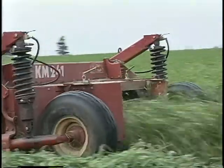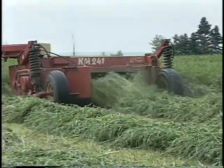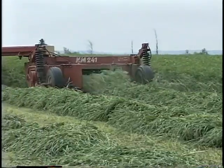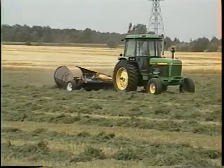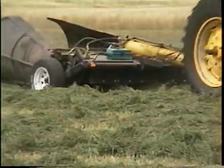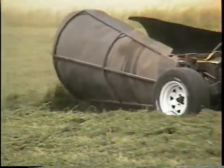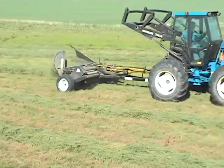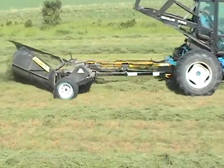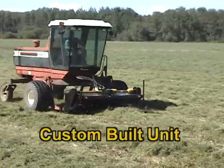Most owners plan to cut today with a mower conditioner and recondition later today or tomorrow morning. If the leaves have dried enough to be fragile, they ReCon first thing in the morning when they're still dew on the plants. When the hay is reconditioned after it starts to cure, the stalks will hold a kink and the swath stays fluffed up. The breeze goes through the swath, not over it, and dries the core. Some operators have said they were able to bale later the first day after cutting if the breeze was right, but usually it's the following day.